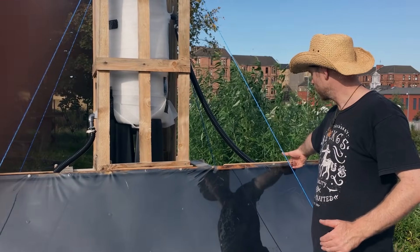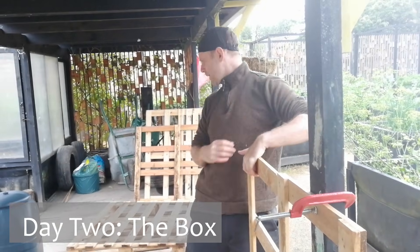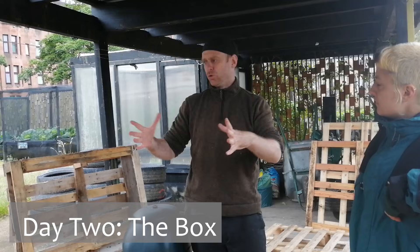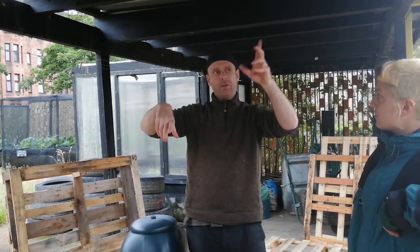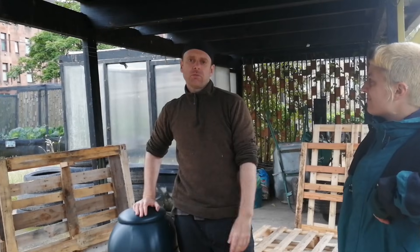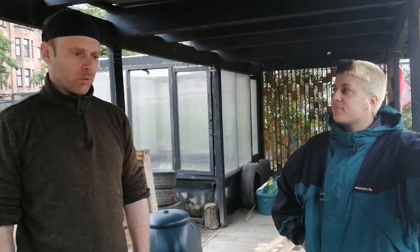The water goes in between, just ballooning those two sheets of galvan out very slightly, and that creates a lattice of space for the water to come through. It gets hotter as it goes and rises as it goes, then comes out through the back. Day two, we are building a box for the tank which holds the water, to keep everything contained and locked to the roof of the shipping container so it's less likely to blow away or fall over.